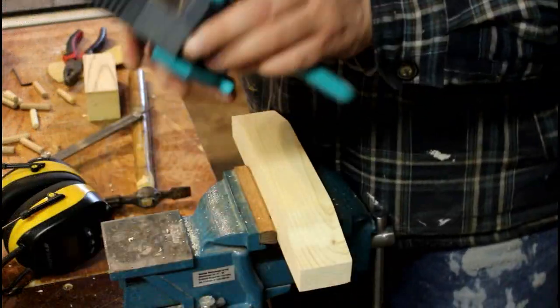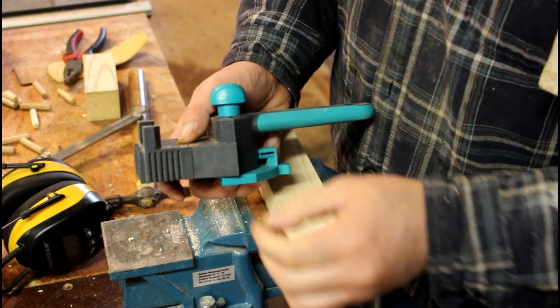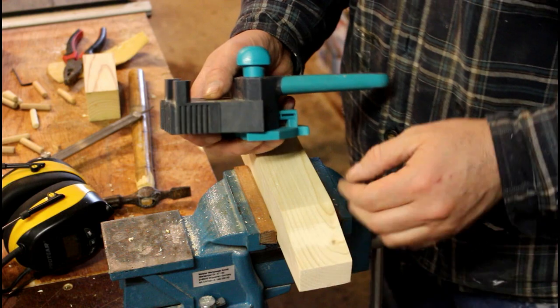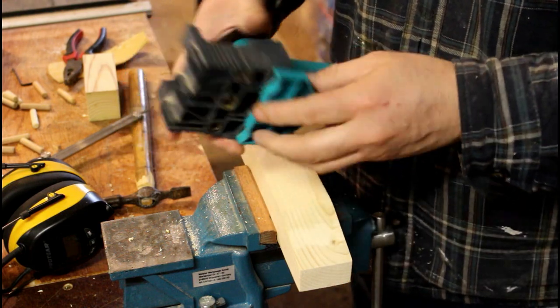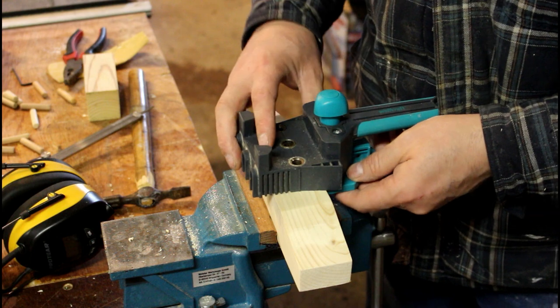Okay, so the way that this works is on the side of your Dowelmaster, you've got this line here and that represents the centre of the hole. And what I've done now is I've worked out what the centre of the board is I'm going to drill into. In this case, it's the foot. And I've set this adjustable depth stop here so that when I put the board on and push it up, that line now is on the same line as the centre line